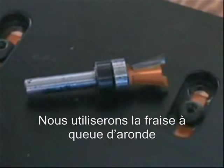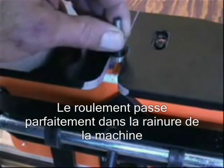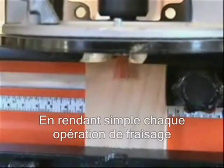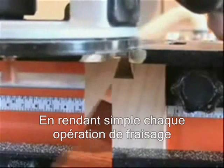At the heart of the N-Lok Jig is a pattern style dovetail bit. The bearing on the bit rides in and out of the dovetail socket guide in the N-Lok table, making it very easy for you to cut perfect dovetail sockets every time.